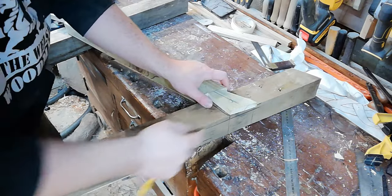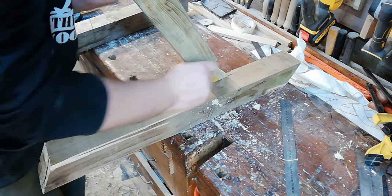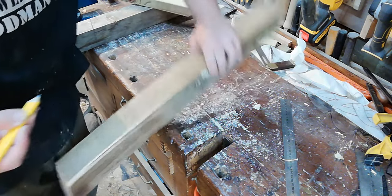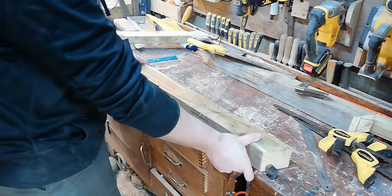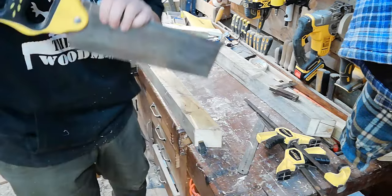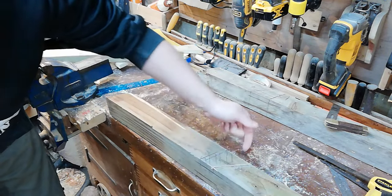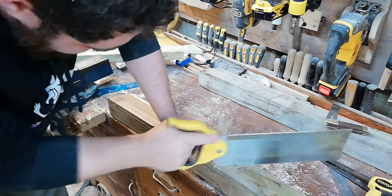I need to establish how far I'm going to need the saw down, so you can set a marking gauge to this thickness and place it against the edge to score across, or you can use your finger as a gauge and score down on your sides. I'm going to put my piece down between these two little bench dogs and use the side vise to clamp them in place, then use a tenon saw on these lines, using my thumb knuckle as a little gauge to start the cut off. Once I've got my groove accurately in there I'll be looking either side of the line to make sure I'm sawing right down nicely and accurately, stopping before I get too far down.